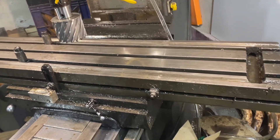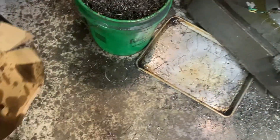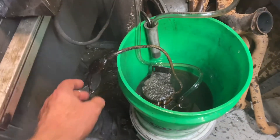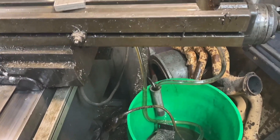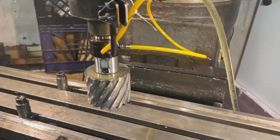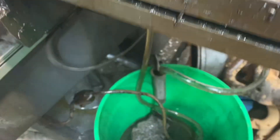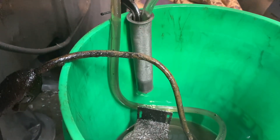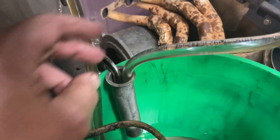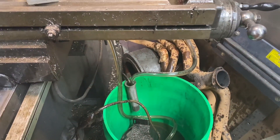This is the annular cutter. I had a pump that came with my bandsaw — it's 110 volts — and I rigged it up with some 3/8 inch clear tubing. The supply line is right there and the return goes down into the bucket. The bucket has a little metal screen clamped on the side that the return line goes into to catch chips so they don't get sucked up by the pump.